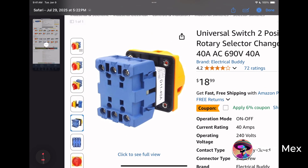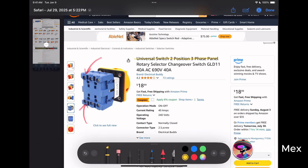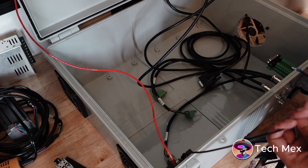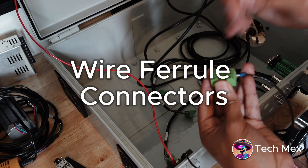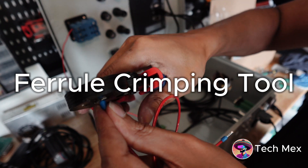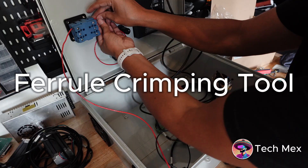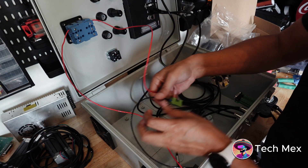One trick: whenever you buy switches, Amazon sometimes includes wiring diagrams so you can see what is going on. I had never connected industrial switches before, but the diagram made it clear. These support 40 amperes. Once I understood how to connect it, I wanted a control box with those modular connectors — they are very helpful because I knew I would have to connect and disconnect the box repeatedly, and they make cable connections much tidier.